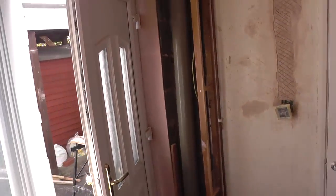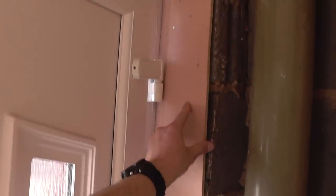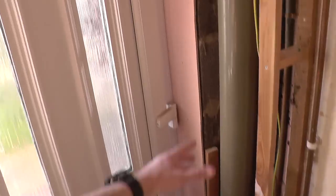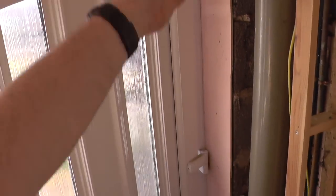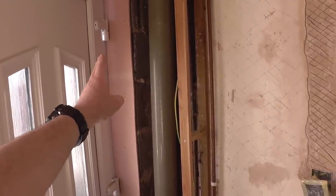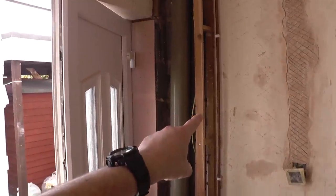So the frame is now a lot more substantial than what it was. To bring it out to the right depth I've nailed some six mil plywood to this breeze block wall here. It's very, very sturdy and it's brought it out to the right distance from the wall. It's nice and plumb and flat to enable the board to be fixed across this area down here, and obviously we're going to put a bit up the side there as well.